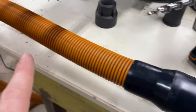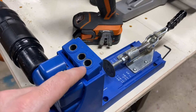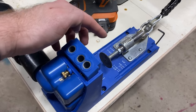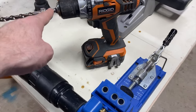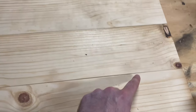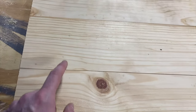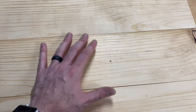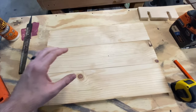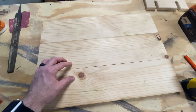The vacuum attachment is going over to my Ridgid vacuum and we're going to run the boards. I recommend - even if you're familiar with these - run a test cut or two with a scrap piece of wood that's the same thickness prior to drilling your actual boards. Over here, I'm going to make some hash marks on here to where I want to drill so that I don't stagger them up and they're not on the exact same spot as each other. I could just clamp and glue this and it would probably be fine, but I'd really like to have the pocket screws just to give it some extra support.